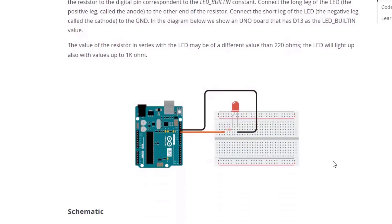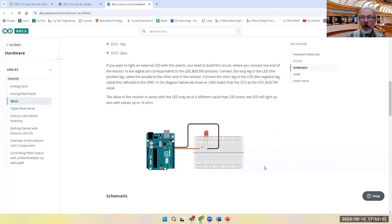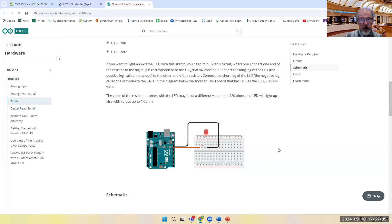You need to know which one's the anode and which one's the cathode to get it to turn on. The 220-ohm resistor is there so the LED doesn't blow up — we're not applying five volts directly. We want some voltage to drop across the resistor to regulate the current. Too much current makes it brighter to the point where it burns out or reaches maximum illumination. So don't apply five volts directly; 220 ohms is a good value, and you could go higher.